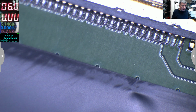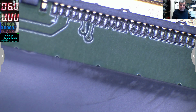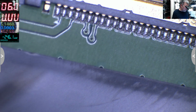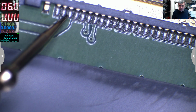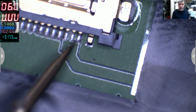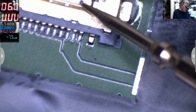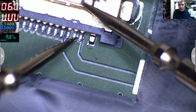Yeah. So obviously, it's so obvious, you know, when I look on the screen connector, probably these two are for 3.3. Yeah? You can see these two. Probably this is for 3.3, which is not power demanding, but the 19 volts it is. Yeah? So probably these three, all three together, yeah, are the 19 volts. So let's check together again. Here, and you can see we have 19.